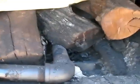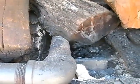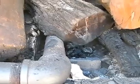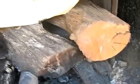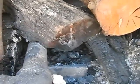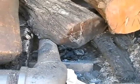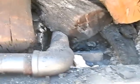You can't really see too well because I have this fill of wood right now, but this is the air that I have feeding into the secondary burn — it basically comes in here and goes straight back into my injection nozzle mixer, or whatever you want to call it. I have it set up so it'll burn up the top wood, the ashes fall down to the bottom, the gas has to travel through those and then goes into the secondary burn.